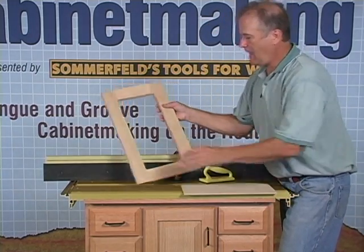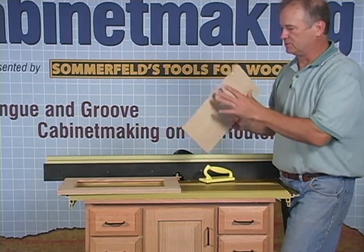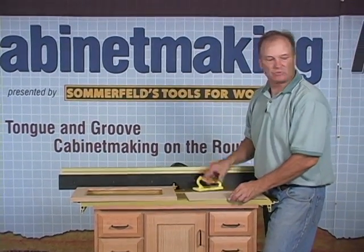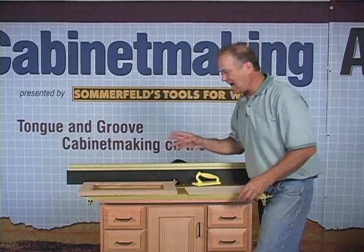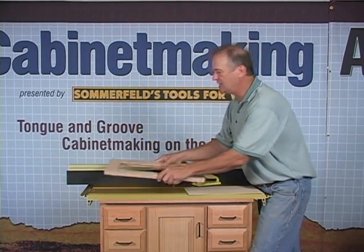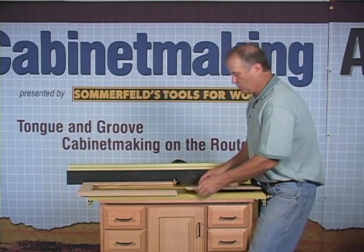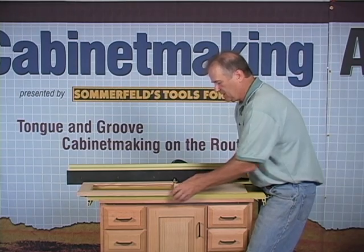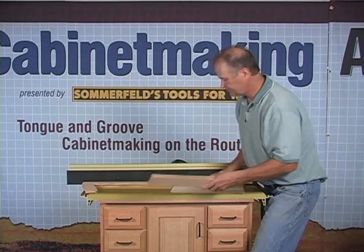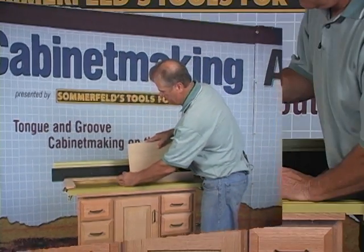Now, most plywood nowadays, when you buy it, is undersized plywood. A 1/4 inch piece of plywood doesn't measure 1/4 inch. It's usually right around 7/32. That's why this shaker set of ours is designed not to cut your typical 1/4 inch groove in here. It only cuts a 7/32 inch groove. That way, when your plywood goes in here, it's not going to rattle like a lot of sets will. So we're going to come in here and stick our plywood in here.